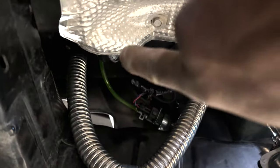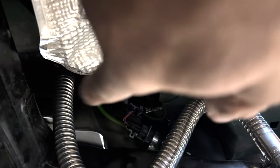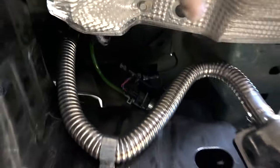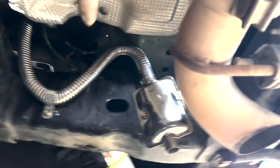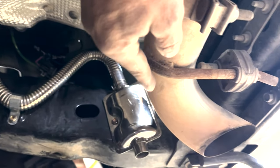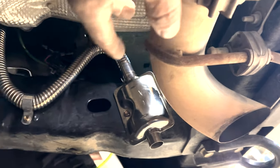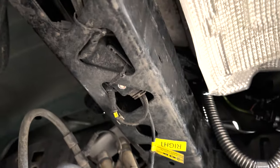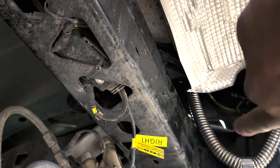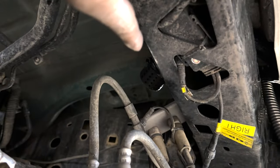You can see the fuel line goes out and across away from the exhaust pipe here. That way, if ever anything happened, it can never come into conjunction with the muffler. And so that gives you a good idea of what goes on here. And see, this comes down and around and is attached to the frame. It's higher than the high clearance exhaust, so it shouldn't touch anything. And then I just routed the air. It goes around here and back there, and you can barely see the head of it sticking out right there.